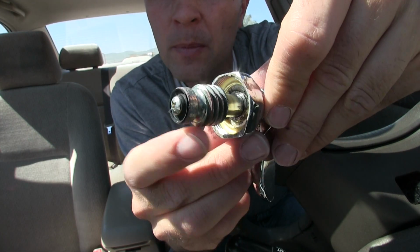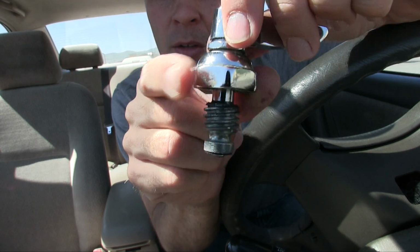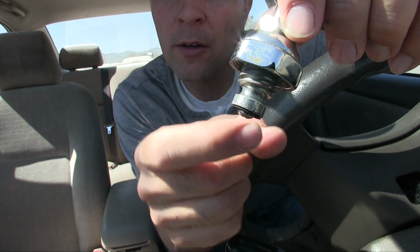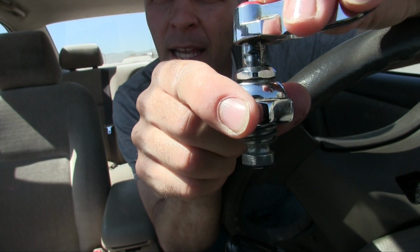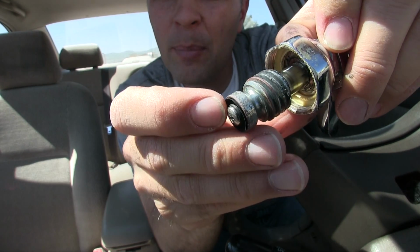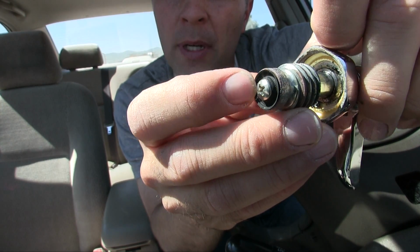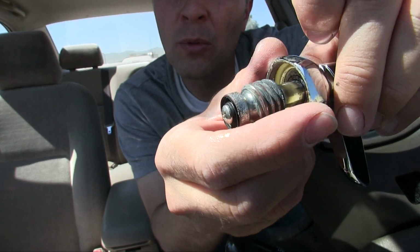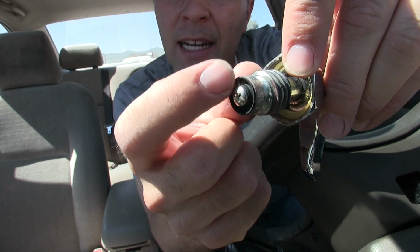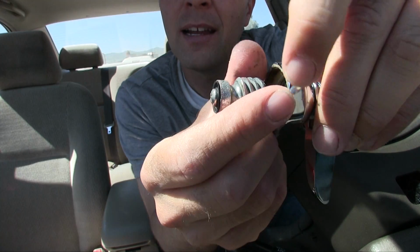I'm here at Lowe's. I'm gonna look for a new washer, but let me show you what this problem is. When you turn the handle, these threads move inside and this whole valve comes up, and that allows the water to flow. When you turn the handle again, the stem goes down, and because this washer is so smashed and deformed now, it just allows the water to leak, and you really have to crank it super hard to try and shut it off. So this is not going to get better with time, only worse. So we're just going to have to replace this little piece there, and we're good.